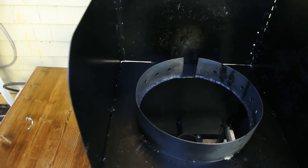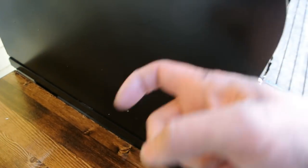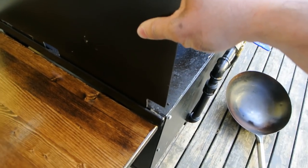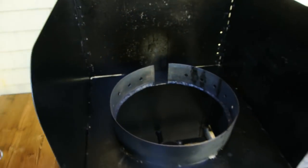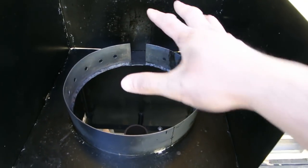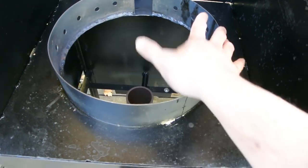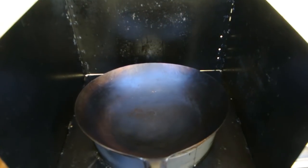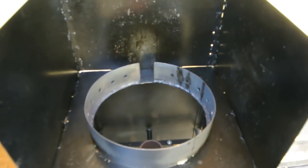This splash and flame guard is removable. I have a slot here and this is a groove with a piece of steel — it just fits in like that with a key. This splash guard is completely removable in case I want to put a larger pot on this. I sized this ring to be 12 inches across, slightly smaller than my wok. This is a 14-inch wok, so it fits really well.